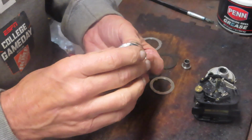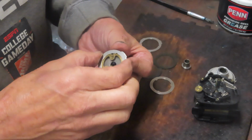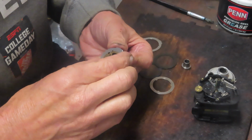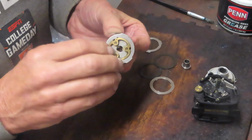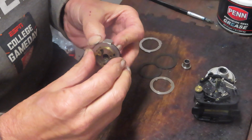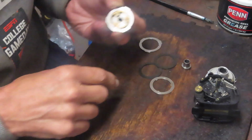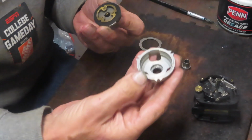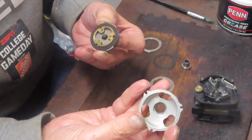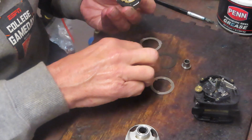Okay, drag washer, first of the keyed or exterior bound washers. And it looks like from the way that this is set up, you want to align the tabs on those keyed washers with those big tabs. That's because the inside, I noticed as I was taking this off, has those 3 slots, and in order to get the whole assembly in, you're going to need to have them line up.